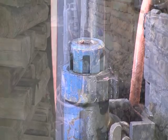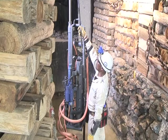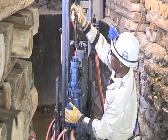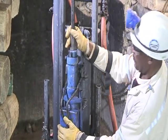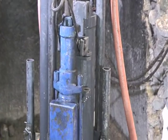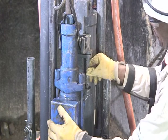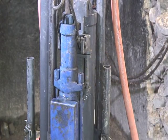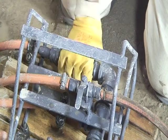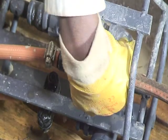Push the longer drill steel into the drilled hole. Then swing the drill back into position. Place the drill steel into the chuck and latch it. Lock the drill by reinserting the secure locking pin. Return to the safe and supported area of the remote control manifold.